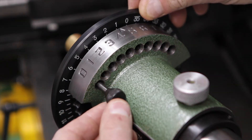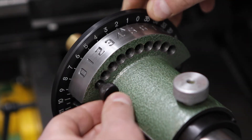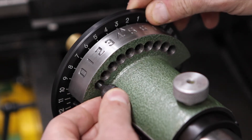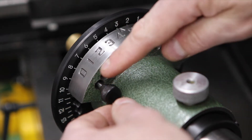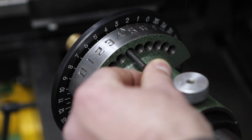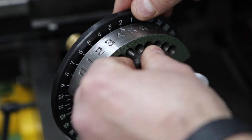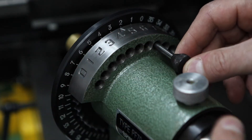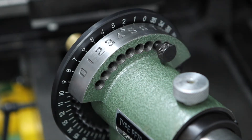The way we select these divisions in units of 10 is by using the pin in the zero hole - so we've got 10 degrees there, 20 degrees, 30 degrees and so on. If we wanted to select a division between 20 and 30, we would move that pin into one of the corresponding holes. For instance, put it in the four hole and move that index back and it clicks into the hole at 24 degrees. If we wanted to move on to 27 we'd put it in the seven hole and move the indexing plate around to 27 and lock it in. So in summary we can divide the circle very accurately into 360 divisions or any factor of 360.